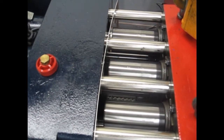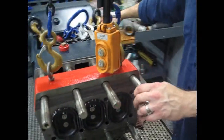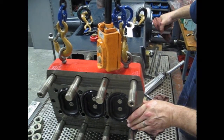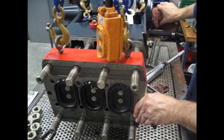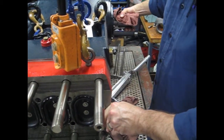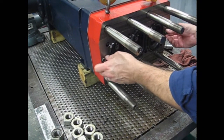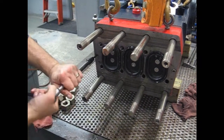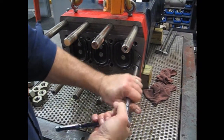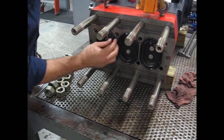We go to assemble this, and we want a nice lining up of the plungers to the cylinders, and if they're not, you will more than likely get stuck here. That being the case, we can turn the crankshaft in and out, which will self-align the plungers inside of the cylinders. And once you can go pretty much once around, it should hold together just nicely. Our holding bolts for diaphragm plate. Okay, line our diaphragms into their beads.